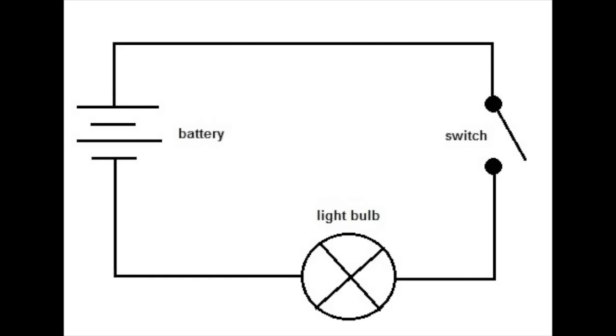So this is basically a representation of what a mechanical box mod does. You put your batteries in, you close it, you tighten up your contacts, and then it is an open circuit. Okay, as soon as you push in that fire button, which is considered the switch, it closes the circuit, meaning that now everything is making full contact, and the coil, which in this case is represented as a light bulb, will glow. But on a mechanical box, once you have your RDA connected to your mechanical box, the coil that's in your RDA will glow and light up because it's creating so much resistance because it's slowing down the flow of electricity.